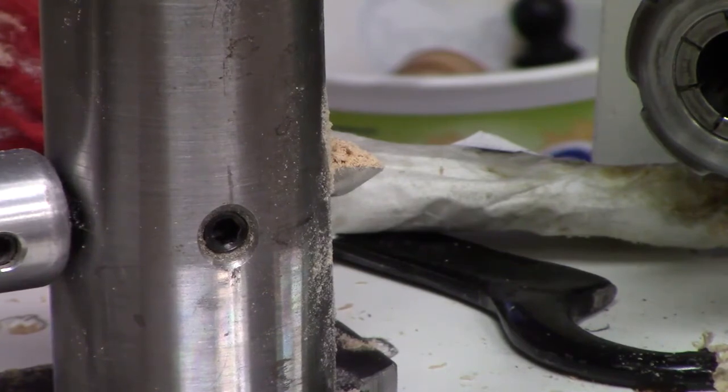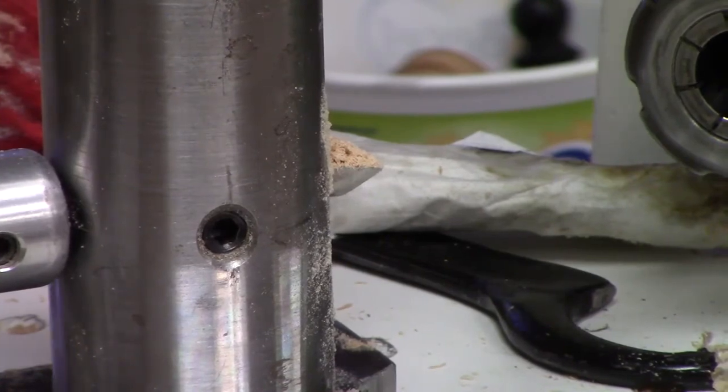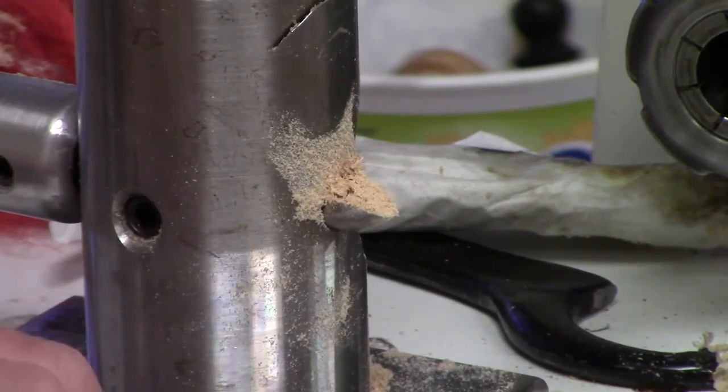But here's a case where I had a pen that I gave to somebody 20 years ago, and I saw them a few years back, and they still had that same pen, and they used it all the time. I had used carnauba wax on it, melted it in, and it was really quite the same. Because what will happen too is a patina will develop. Yeah, it did develop a patina. But friction polish, I've used that on pens, and in 3-4 months it's gone.